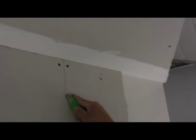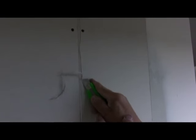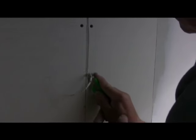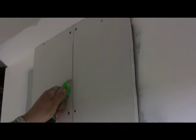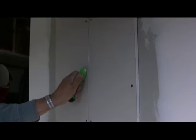It is also good practice to V the butt joints. A butt joint is where two pieces of drywall meet in the same plane and have no indentation. Using a sharp knife, cut a V into the joint that is about a quarter inch across the top. What we're doing is cutting off the paper that often protrudes slightly and makes the butt joint harder to hide.